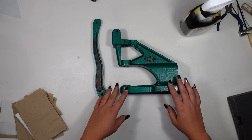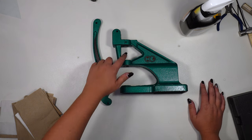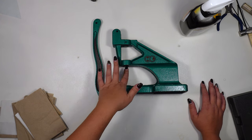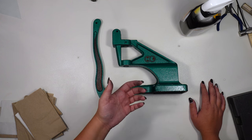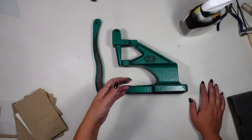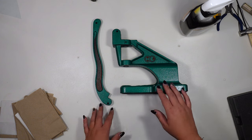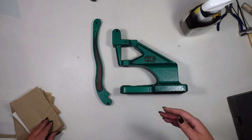A couple of things we don't want to do at this stage: we do not want to soak any portions of the rivet press that are not currently coated, as we can see some uncoated areas here — they may rust. I'm not sure exactly what type of metal this is, but much like a cast iron pan, if it is not seasoned, coated, or sealed from rust, it might rust. So we don't want to cause any rust. If you currently have rust on yours anywhere, go ahead and remove it before we paint by simply cleaning up your piece.